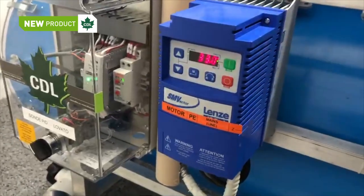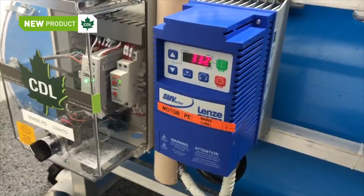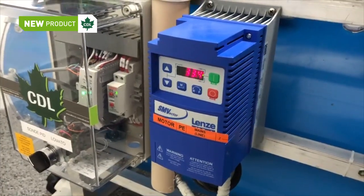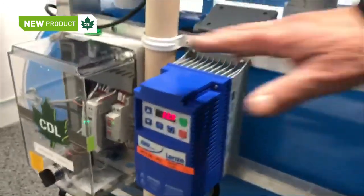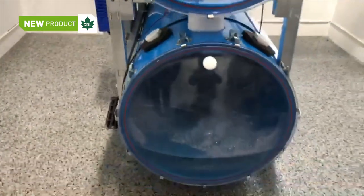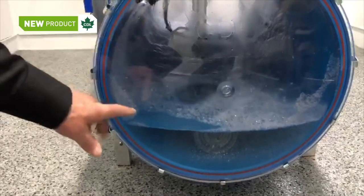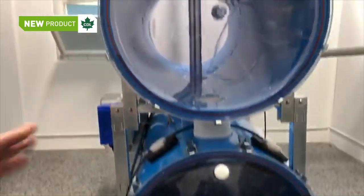You can see here the frequency the pump is running at. Right now it's working around 32 Hertz, which means about half the speed the pump will normally work. It can go up to 60 Hertz, which is 100% of its capacity. So at 32 Hertz you're also saving energy and the level of the tank will remain constant. On big runs the level may increase to the middle, but on a small run like today it will maintain just slightly below the middle of the container, and will keep up like this all day.